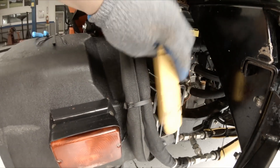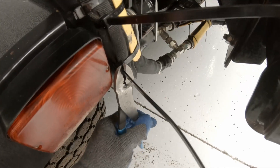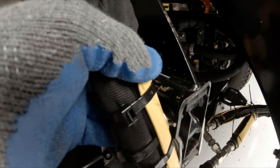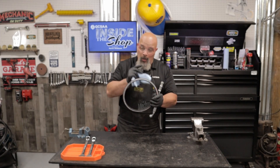We have these covers that you can get at your hydraulic shop — just lay it over the hose. You can also use an old radiator hose, wrap a few zip ties around that, and now the hose is protected up against the frame and we're good to go. Being able to identify the signs of a hose that's getting ready to give is invaluable.